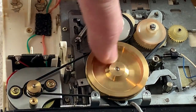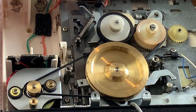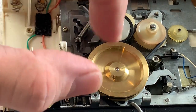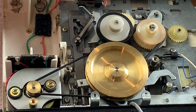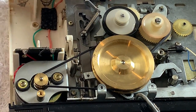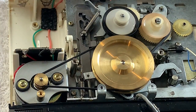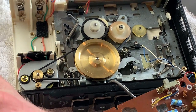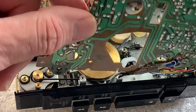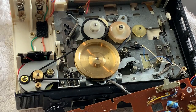You can see why it's worth using decent belts for stuff like this - how true they run, it's just gorgeous, and obviously that will be reflected in the quality of the sound reproduction. I often said at this juncture that I use the cheap multi-pack belts sometimes just as a tape measure to measure up and see which is the right belt before ordering a proper one. But there's no point making a false economy - when we've just taken off about eight or nine solder joints to change belts, if you shortcut at this stage you'll just regret it later.